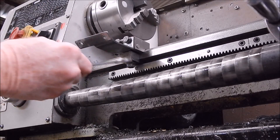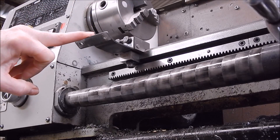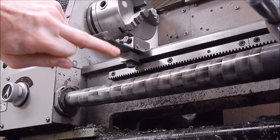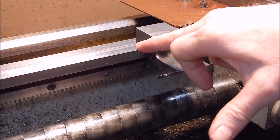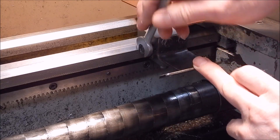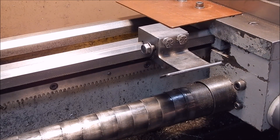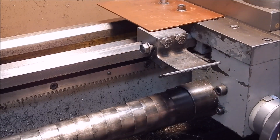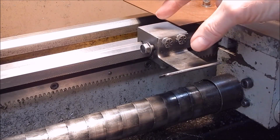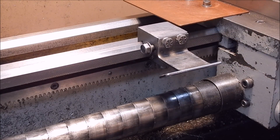Here's a view from underneath. You can see the bolt — I just use a spanner to tighten and loosen it, slide it up and down. It can't mark or hurt the ways, and the block works on exactly the same principle as the carriage lock — identical. Moving to the back, here's the adjusting bolt that goes through, which allows you to adjust and come up against the edge of the carriage. You can see how I've got the plate that goes over the top of that, which is why I've got the tightening bolt underneath. But you could easily put the bolt on top and bring the block out as far as you want with the pivot point further out.